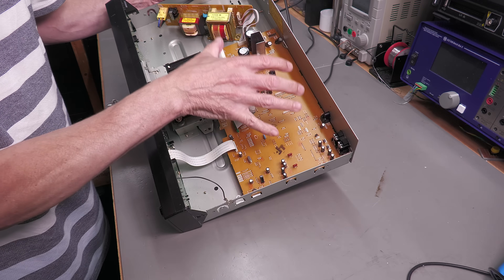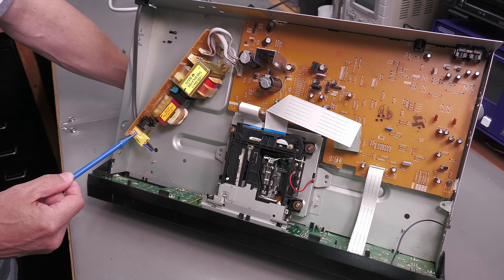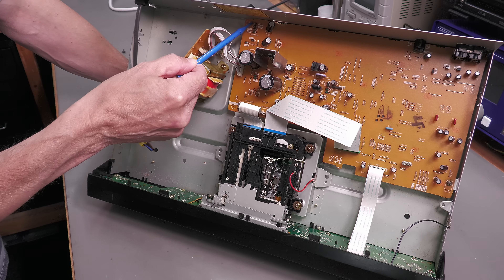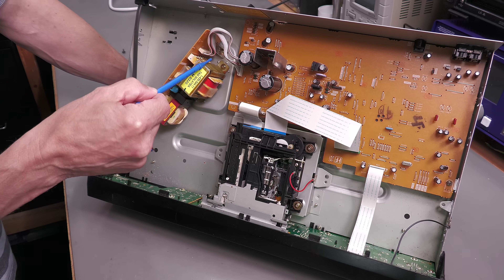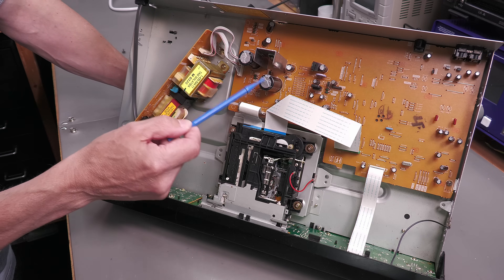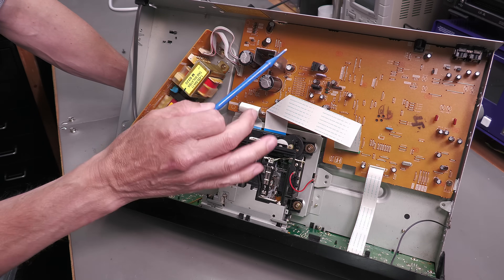The through-hole components are on this side. The power supply looks to be a linear design — we've got a transformer with mains coming in on one side. There looks to be a relay down there. We've got a bunch of diodes forming a bridge rectifier on the main board, with the transformer secondary connecting down via a connector. There's a 5-volt regulator and a couple of bulk capacitors. Before removing any PCBs I'm going to measure the power supply voltages.